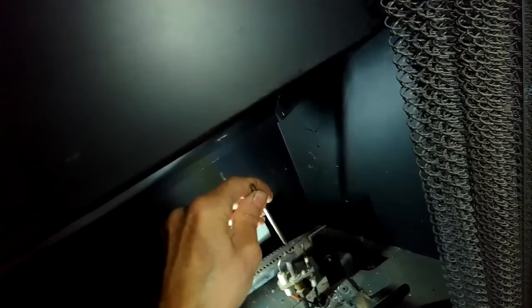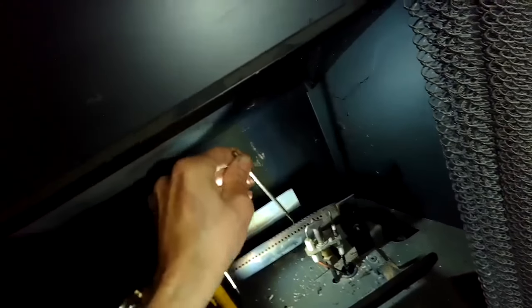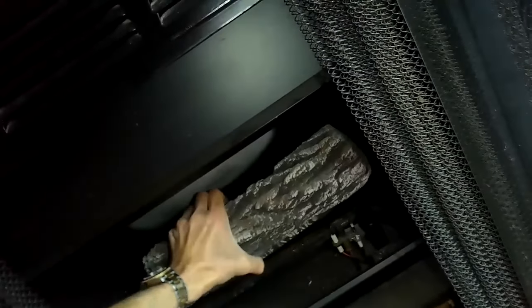I'm cleaning out that pilot hole where the gas comes out using a little dental tool. Remember, you don't want to push in real hard into that hole or it becomes bigger — too big an amount of gas comes out of the pilot and that's not what you want. I'm also pushing into the little holes where the main gas comes out. Then I'm going to put the logs back into position.